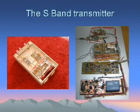The satellite has 3 S-band patch antennas. Here we've got a 3-way splitter, so the power output from the amplifier goes into the splitter, and we've got one primary output, which is minus 3 dB, half the power going into the splitter, and we've got 2 minus 6 dB outputs. These are a requirement for the testing of the antennas that are on board from the university in Poland. They're not our idea. They're actually trying out some new patch antennas. They're very, very good, excellent performance, but in my opinion it's not the ideal configuration. This will go off to the antenna, which hopefully will be looking at the Earth the majority of the time.